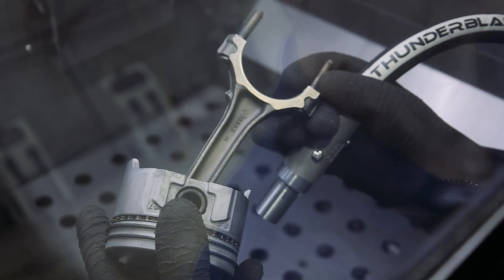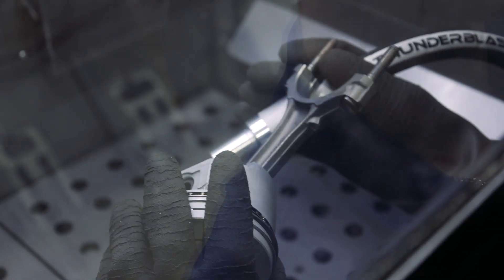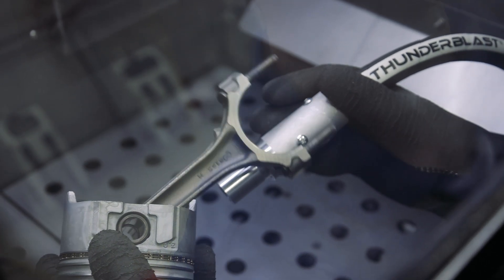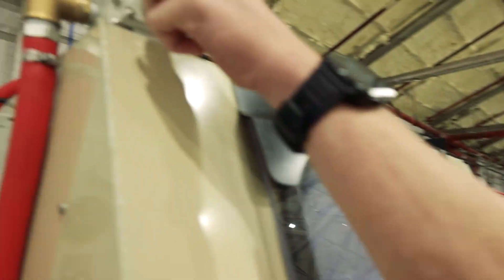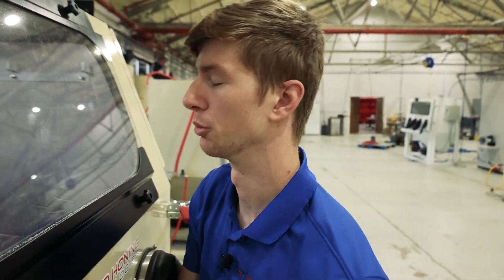So you're not exactly hardening the part, but you are strengthening it. To demonstrate, I'm going to be using a connecting rod — a used one coming out of our Ford Mustang V6 motor — just to show how shot peening is going to affect the surface. I'll be running around 50 PSI working pressure when actually blasting.